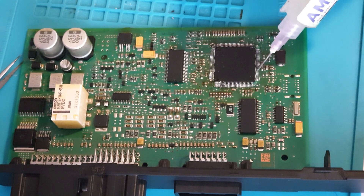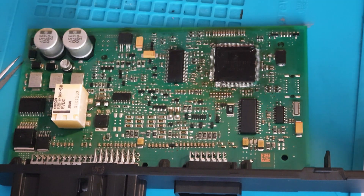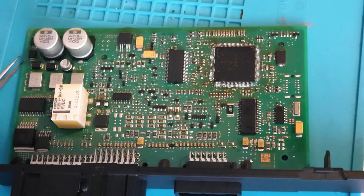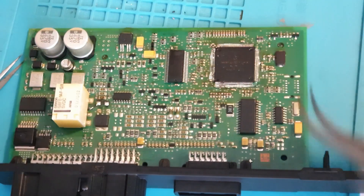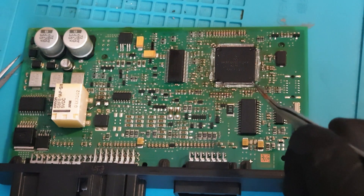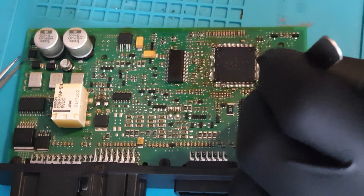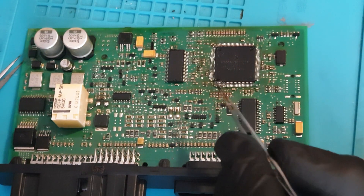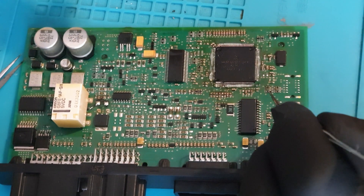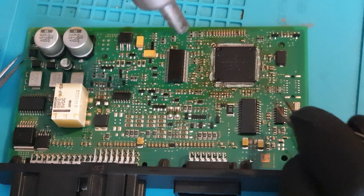The principles are the same. First of all we're going to put some flux on it, then get the hot air. I'm going to get the tweezers — it's basically going to sit flat in between the legs on the corner, and I'm not going to be putting any pressure on it really. It's basically just going to be sitting underneath it, so when it eventually does lift it's just going to nice and easily lift off the board.